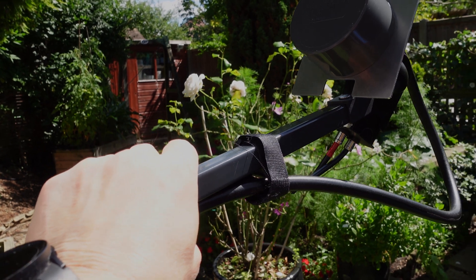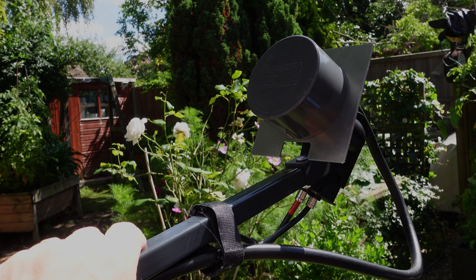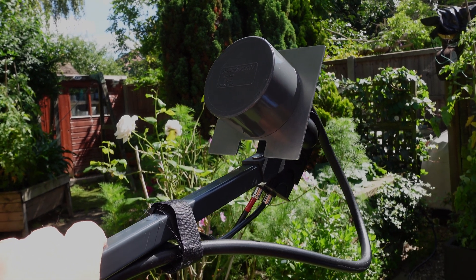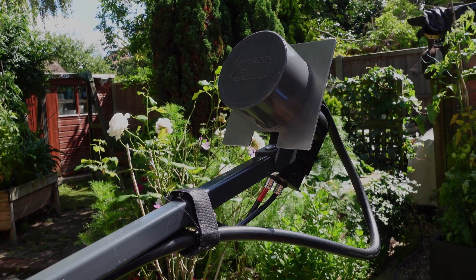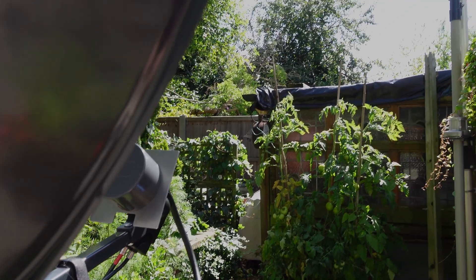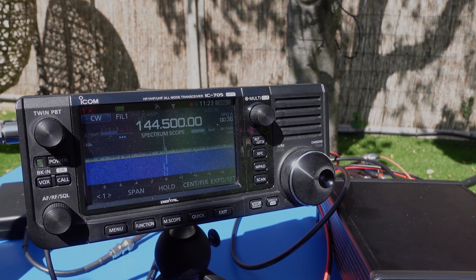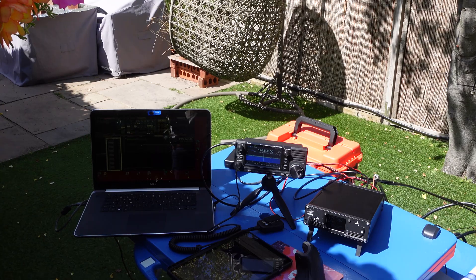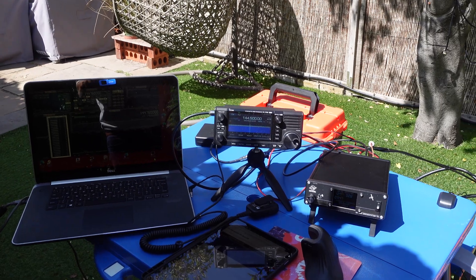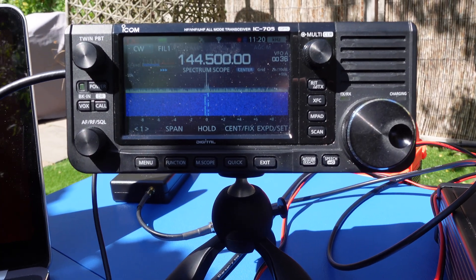Once you've set the azimuth and elevation of the dish, it's time to turn up the audio on the radio or SDR and tune it to the correct band — this has to match the received band on the ground station. Look at the waterfall display to see if there are any visible signals. If there aren't any, slowly change the azimuth of the dish from one side to the other in very tiny incremental steps. With the ground station receive set to 144.500 MHz, I was able to hear very faint CW on the lower part of the band.